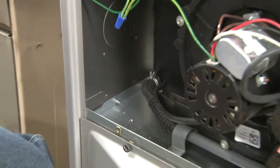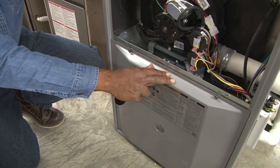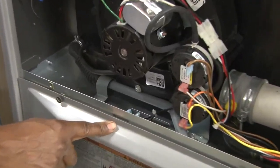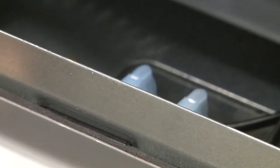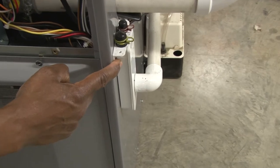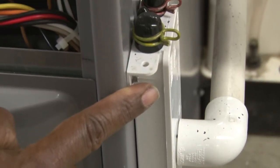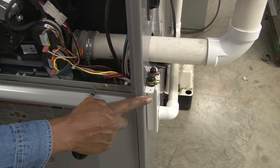The other part is the lower portion of this furnace, which is the blower section. To run this, the blower has to be on. There's a switch behind the door to allow the system to operate when the door is closed. If I open the door, it will de-energize the system to keep it from operating for safety. On the other side of this furnace is the collector box to collect the condensate that builds up inside of the furnace based on the heat extracted from the flue gases. As it extracts, it will condense the flue gases back into a liquid from a gas, and then it will drain to the floor drain.